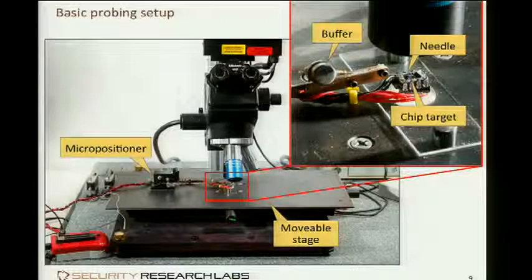It's already hacked. Mostly when you hack one of these devices, you would use a UV attack. UV light erases the microcontroller, including the fuse, but when you find the EEPROM memory on the chip and cover it with paint, then it cannot be erased anymore, but the fuse is getting erased, and so you can unlock the chip and read back its contents. The cables you see here are running down to a programmer. The red little thingy is an EEPROM programmer.